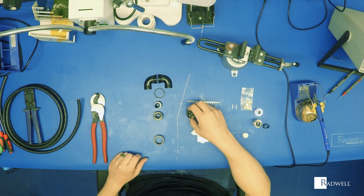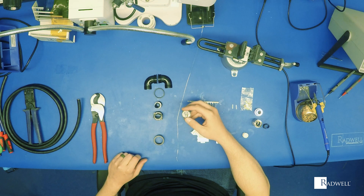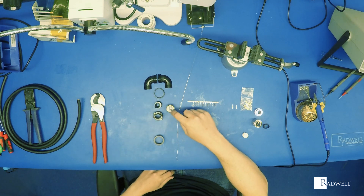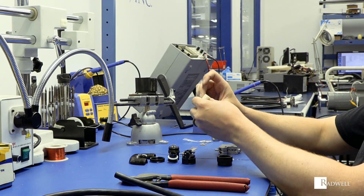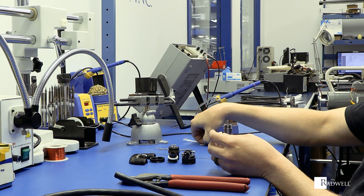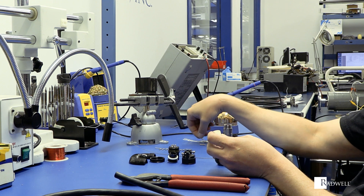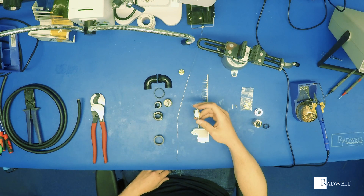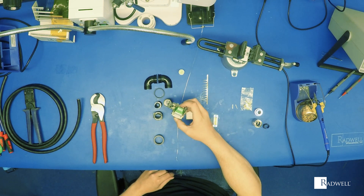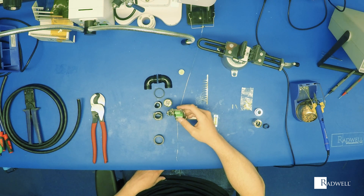Before you begin, you want to select which connector you'll need for your project. You'll have to figure out the connector itself, the gauge wire, and what type of connection point you want. One type is a solder cup where you solder directly to the pin mounted inside the connector. You also have a crimp style pin that clicks in after you crimp it onto your wire, or a solder type plug-in. These different types also apply to your D-sub connectors — this is a 15 pin D-sub with solder type connections. One other connection type is a terminal type, which is my favorite because it's the easiest to change and modify, and there's no soldering required.